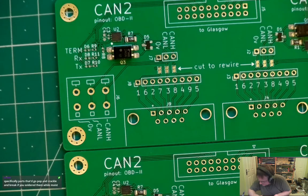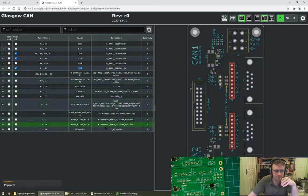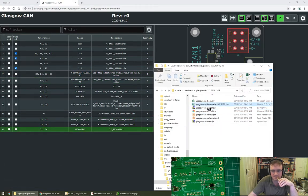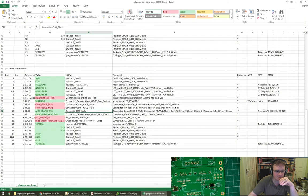Now these LEDs — green clear 0402. Looking at the BOM: this BOM looks like it's wrong. Oh, I did fix it up by hand because it was wrong, and I changed the LEDs as well for availability reasons. Green is D3 and D7 — those are the transmit LEDs, supposed to be IG which is green.